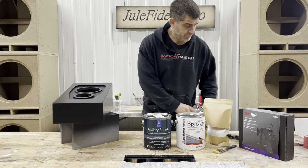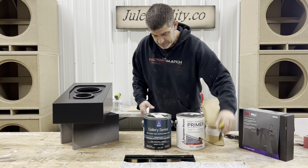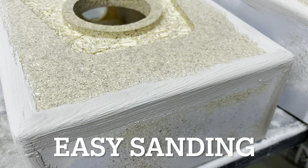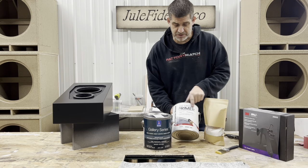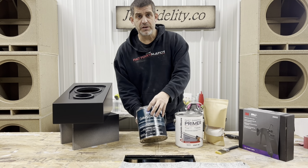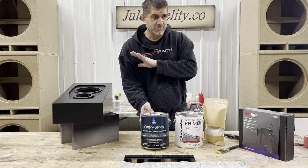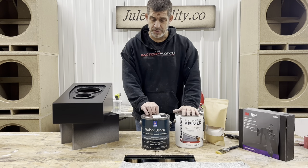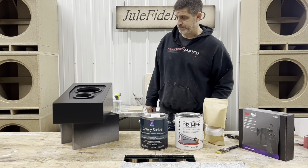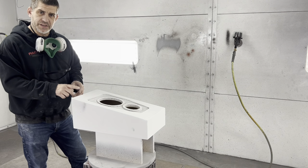Gel coats, glues — all out of the same gun, I just change the nozzle. Pretty cool thing. I will be doing a video on that later. We're gonna use a little body filler — I'll show you a few pictures of how we do that. We just use a brush to apply it. We're gonna do three coats of the Benjamin Moore fast sanding primer that we covered in the previous video. We sand it in between coats, which takes about two to three minutes each time. It sands really easy, gives it a nice hard finish.